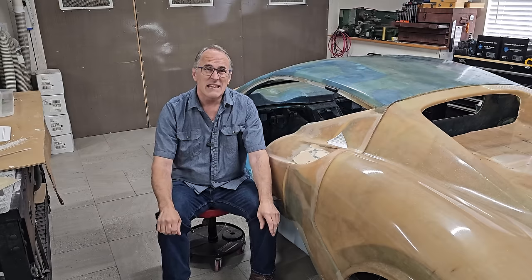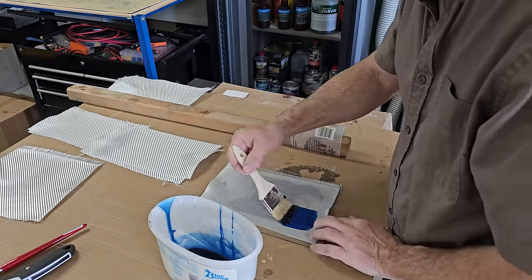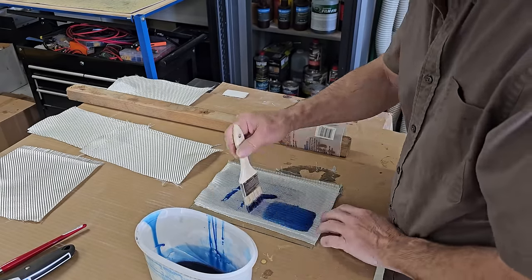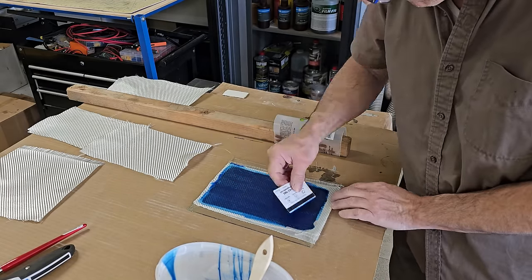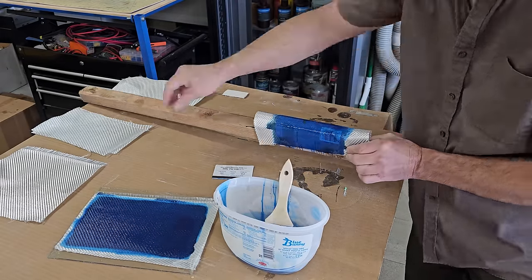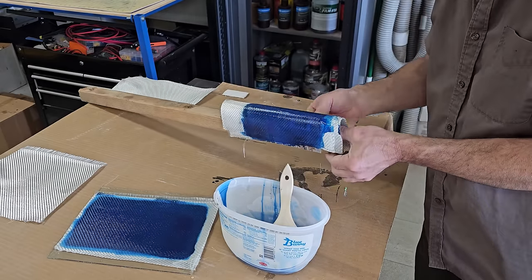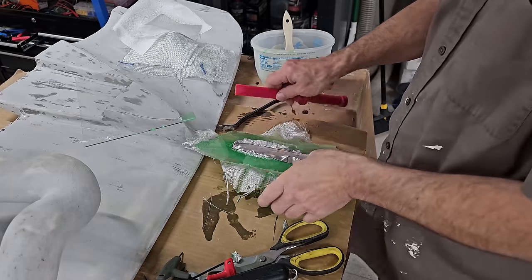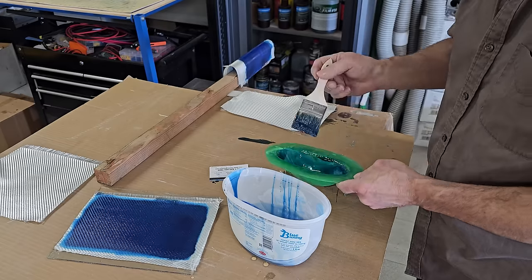Cores are great - we can add a lot of strength without adding weight as we would by just adding more fiber layers. But the real secret to put your strength over the top is geometrics: how your part's shape can play more into strength than the amount of material itself. Let's make up some samples and do some testing. The samples will all use the same amount of fiberglass - three layers of a six-ounce fabric. The first is three layers plain on a flat sheet; the second is stretched into an arch form; the third is a blister shape made from a potato-shaped mold.